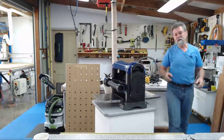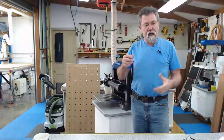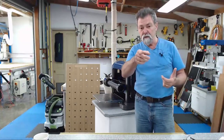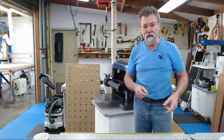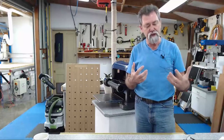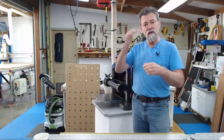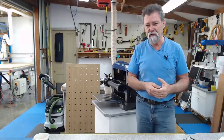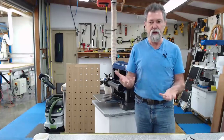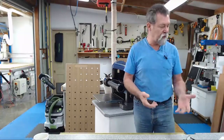And I'm going to run a few different types of timber through because it's always nice to get a comparison. You may understand that some softwoods fall away from a chisel. You know, if you're trying to chisel a bit of cedar, for instance, hardwoods are so much easier to chisel away because they support the grain a whole lot better, where softwoods tend to just push down and collapse under it.